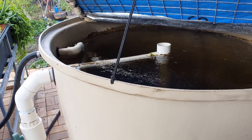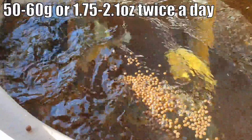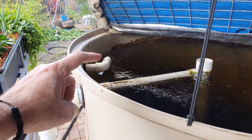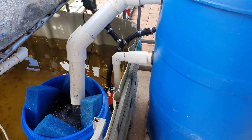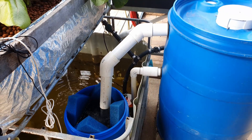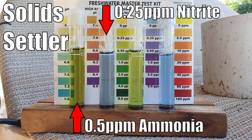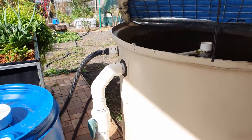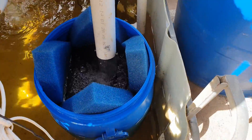I'm starting to see a reduction in the nitrites coming through into the fish tank. The method I've used to test how well the filter is working: I feed the fish first - I throw in 35 grams, and if they smash through that quickly enough I generally give them about another 20 grams, so they're getting roughly 50 grams of feed at the moment. I leave it half an hour, then come back and test the water inlet and also test at the outlet from the radial flow settler - just the ammonia and nitrite levels. After half an hour I'm getting very little out of the radial flow settler itself, and next to nothing - trace if anything - out of the inlet back into the fish tank.